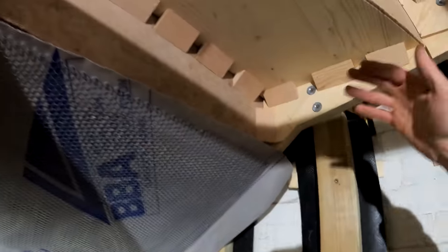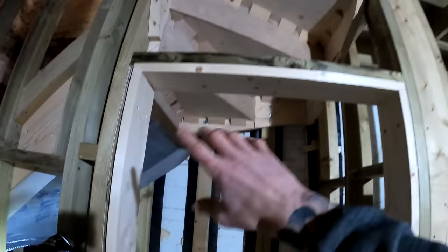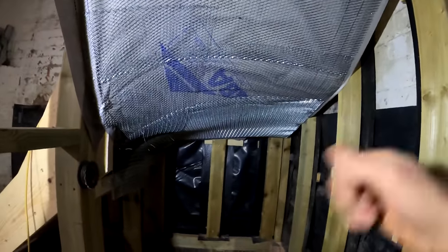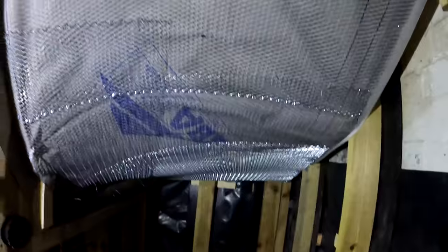That just runs up and that's going to look really nice and effective. I'm going to get a little bit more in here, but I'm going to leave a fair bit up there because we've got a four inch pipe to come across up here and down, so it might be in the way. You could board it, but it'd be an absolute nightmare - trying to get that shape of bonding with board there is going to be a right mission. This is the best, most easy way. Once the bonding goes through there, it's actually got something to latch onto - it's not just pushing straight through. So it makes life easier, you don't get it all in your face. That is a little handy hint: if you're ever doing something like this, just use a bit of roofing felt and you're good to go.